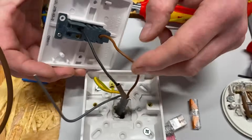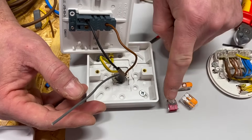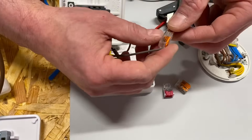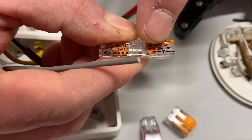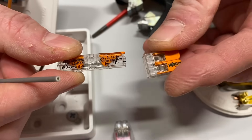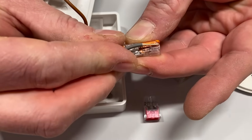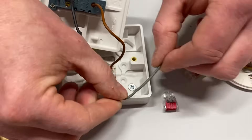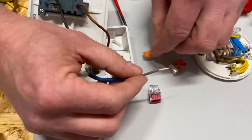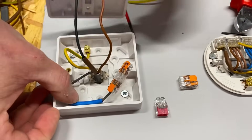So that would be working now exactly as it was before, and we've now got a neutral. I could put it in any of these connectors — I've got both Ideal Industries and Wago connectors — and leave it in the back of the box. You can see on the side the amount of insulation to remove: 11mm. So I remove 11mm, strip that back — pretty good — then I identify it because it's gray, it's not a gray conductor, it's a neutral conductor. So we put blue over-sleeving on, and now we've got a neutral waiting in the switch in case the customer turns it into a smart switch in the future.